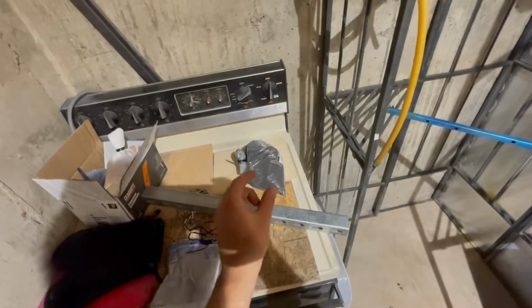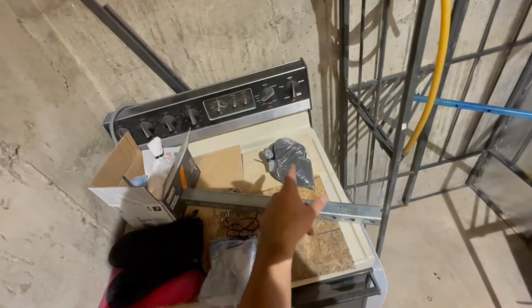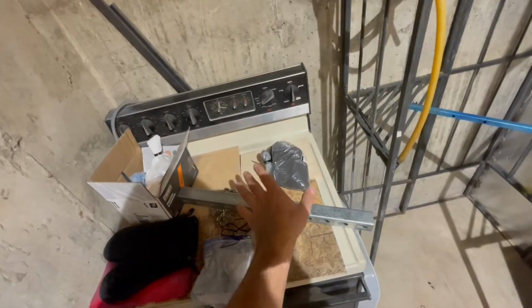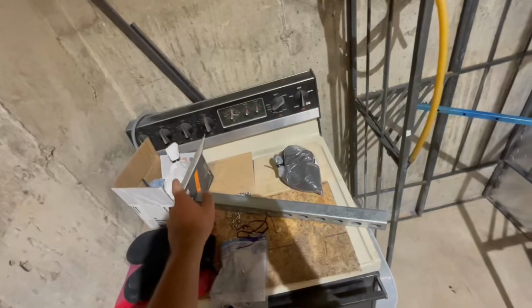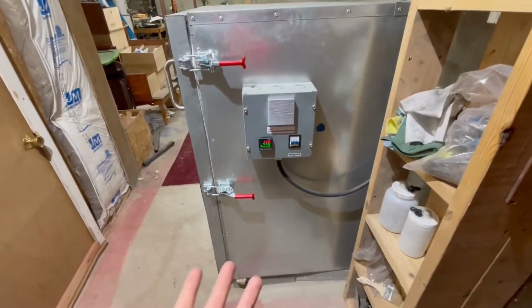I wanted it to not fully cure so that this clear coat can actually bond and hold together with the black. But if they have different curing schedules, I'll just do this at the full 10 minutes and I'll do that at the full 18 minutes. It's kind of better at a lower temperature. But being that this is 400, I need the part to get to 400.